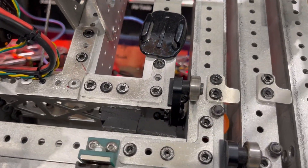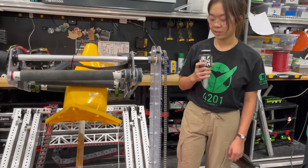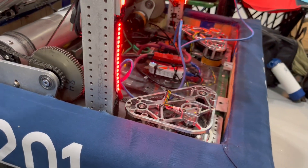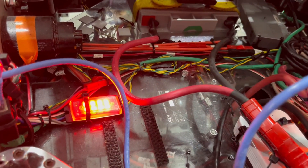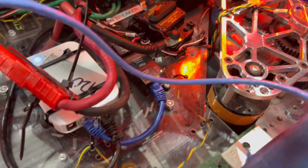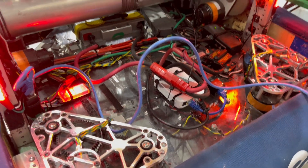This elevator is very clean — one of the best I've seen out on the field. Last up, we're going to talk about some of the electrical stuff and this inverted belly pan. So Momo, take it away. This year we decided to do an upside-down belly pan, which makes fixing issues much easier as the wiring crew can fix the underside of the belly pan while assembly and mechanical people can work on the elevator if needed, creating more flexibility in the pit. We also focused a lot on labeling wires and making sure wire management was really nice, which helped because we had very few electrical issues this year. We used IGUS to keep wires neat and easy to trace throughout the belly pan, elevator, and four-bar.